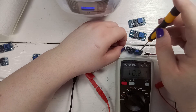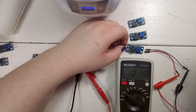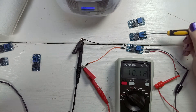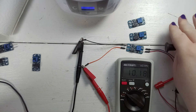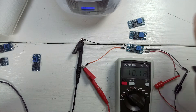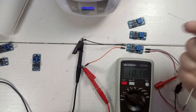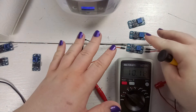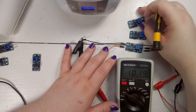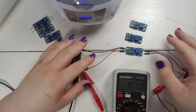Maybe I can emulate that issue if I turn it too far — the one that behaved that way was driven beyond its boundaries. So if I turn it too far in one direction it will be driven beyond its boundaries and have no electrical contact and therefore not work, but if I turn it back it suddenly works. So the resistance value of the potentiometer is correct — it's just that one of these two is still damaged, either needing replacement or leaving as-is.